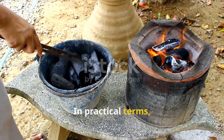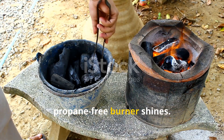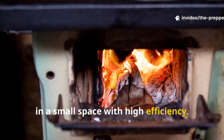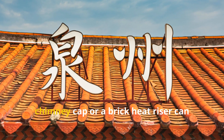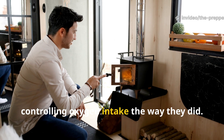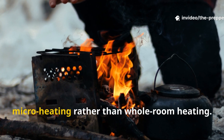In practical terms, this is where a modern rocket stove or propane-free burner shines — the principle is identical: intense heat in a small space with high efficiency. Even something as simple as a clay chimney cap or a brick heat riser can double your burn efficiency, because you're controlling oxygen intake the way they did.